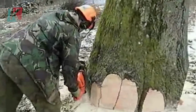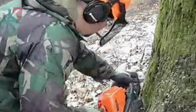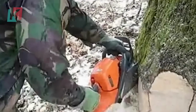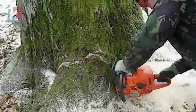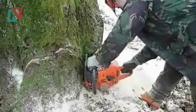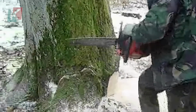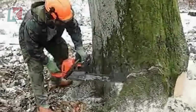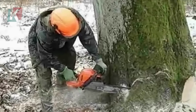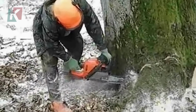For felling a large beech tree, a professional-grade chainsaw is necessary. The Husqvarna 576 XPG, with its long guide bar, 24 to 28 inches, low vibration system, and heated handles, is designed for handling large hardwood trees efficiently. In addition to the chainsaw, felling wedges and a sledgehammer are required to help control the fall. If needed, a winch or rope system can be attached to the tree to provide additional directional support.